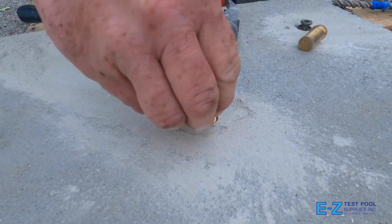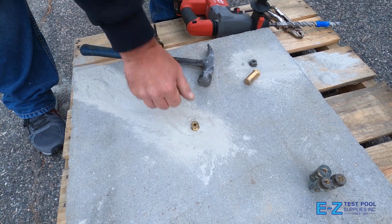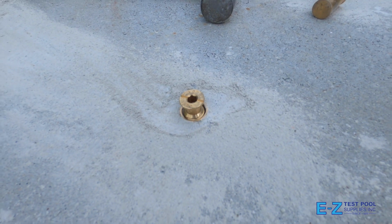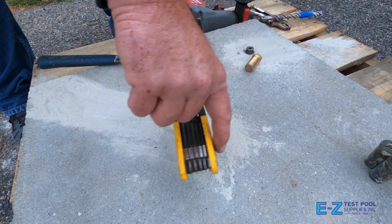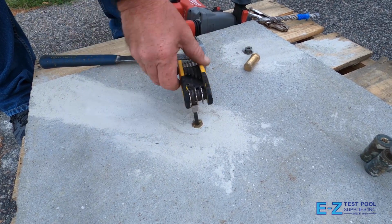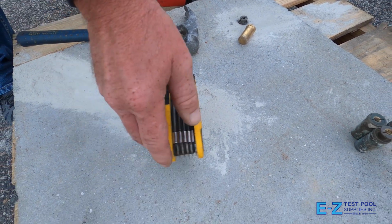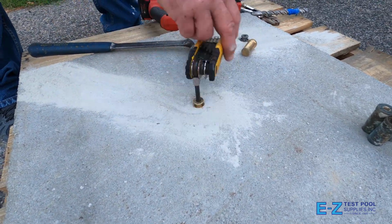You can then thread the anchor head into place by turning it clockwise. Once this is secure, you would be able to hook the spring from the pool safety cover onto your newly installed anchor. To put this anchor down in the spring, it requires a 1/4 inch Allen wrench where you can spin the head clockwise, making it flush with the cement patio during the months that the pool is open. To raise and use for the winter months, just spin in the opposite direction up to the point where you start to see the threads.